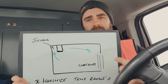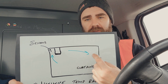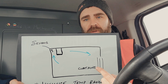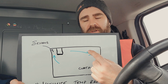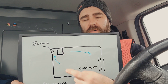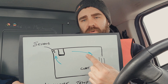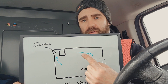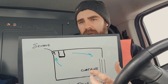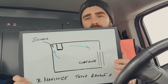These are ways to mitigate freezing of an evaporator coil on a walk-in cooler. Rule number one: keep your evaporator away from the door. This is your evaporator hanging from the ceiling, and this is your door. If your evap was right above the door, as soon as it opened, we'd have moisture and air getting sucked right through the evaporator. Rule number two: keep your sensor on the return air side. If the sensor is near the evaporator outlet, it's going to be measuring the colder air and cause the system to run funny and short cycle. Keep your sensor on the true return air side of the evaporator — this is super important.